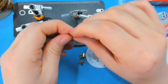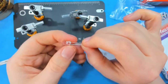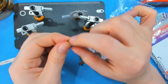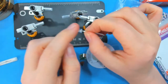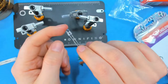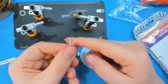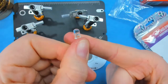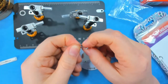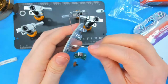Oh yeah, another little feature of LEDs, often through-hole LEDs, is, let me see if I can show you this. On a clear LED, it's a little bit difficult, but the short leg corresponds to ground, and there's a flat surface where the rim of the LED, which goes most of the way around, does not exist right next to the ground leg. So if you've already cut off the legs of your LED and you don't have memorized which side of that interior bit is the cathode or the anode, you can tell by finding that little flat side where the rim has been excluded. And that'll help you figure out which way it is if you can't figure out another way.